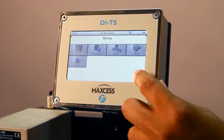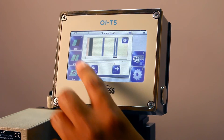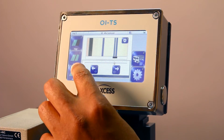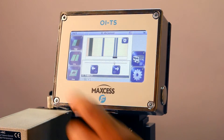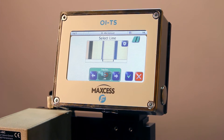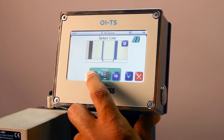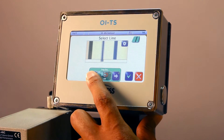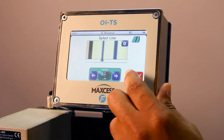Press the back arrows to return to the main screen. To calibrate the SE46C sensor to your material, choose whether you want to guide to the edge of a line, the center of a line, or a 2D graphic like a barcode. We're going to calibrate the sensor to guide to this narrow blue line. You can press the arrow buttons to move your cursor left and right to select which line you would like to guide to. Press the check when you've selected the line.